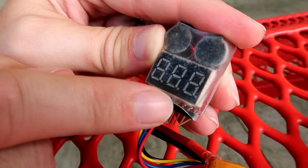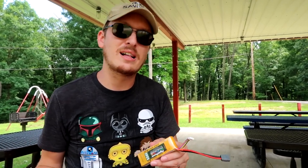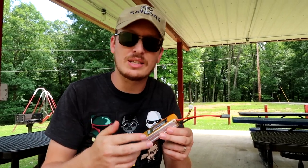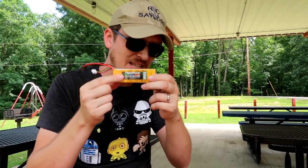When you start getting errors, some guys in this hobby will take their battery, plug it into their lipo charger, set it on nickel metal hydride, and try to juice all the cells up enough to get the lowest one above the safe point, then set it to lipo balance or lipo charge. It does work sometimes — but you shouldn't do it. In this case, one cell is getting an error — potentially very dangerous. I tested it a couple years ago to see if it worked in theory, and it does — but don't do it.